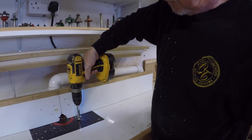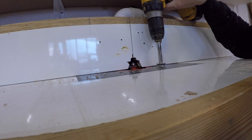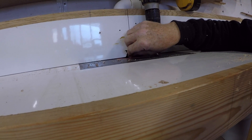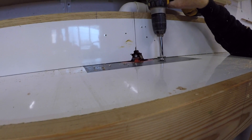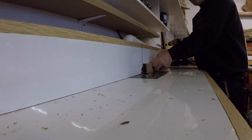So we raise that. I just want the bottom of the curve of the bead to be flush with the table, because you don't want to be taking out a rebate and a bead. So that's it there. Of course you always test it with a sample first.